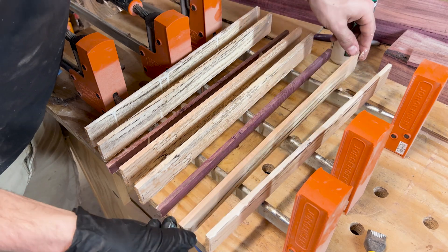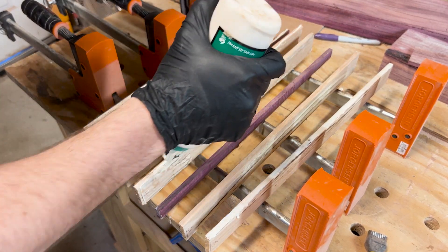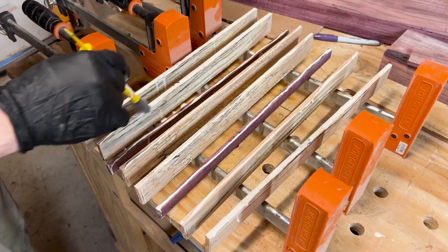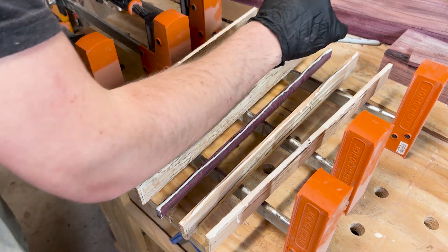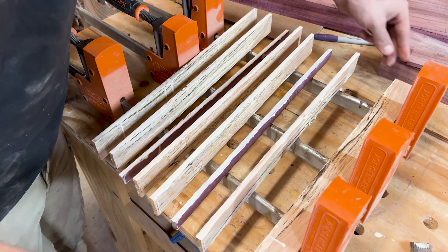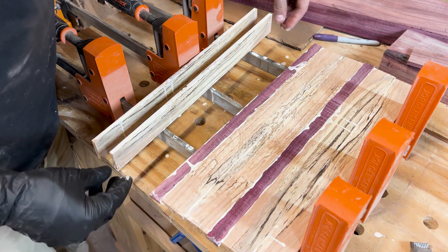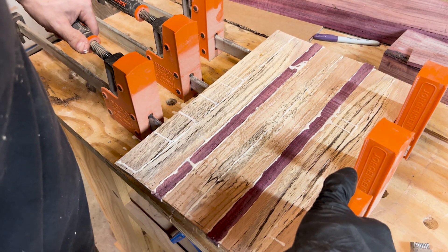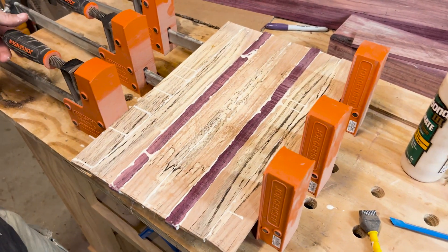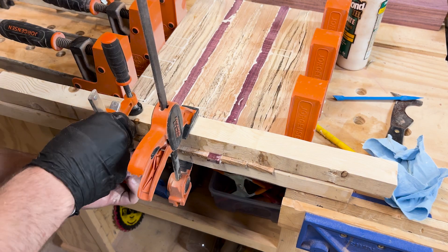The purple heart I had bought from a lumber yard in Bagdad, Kentucky, just a little bit east of Louisville. Purple heart is not native to here but is native to Mexico and farther south into Central and South America. The spalted maple, however, came from a horse pasture in Kentucky — it was a sugar maple that had fallen in a friend's horse field. The horses had eaten all the leaves off the tree by the time I got to it, and after we cut it up and it had sat for about six months, it had started to spalt. Those black streaks you can see in the wood come from a fungus that decomposes the organic material in the wood and replaces it with mineral deposits, giving it that deep dark coloration — that's actually what the spalting is.